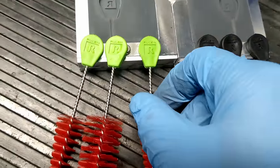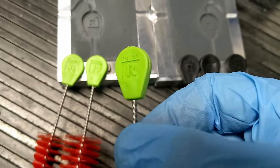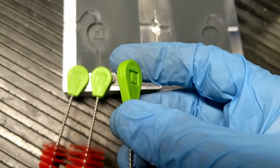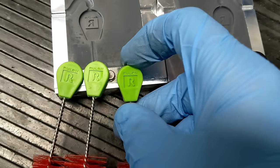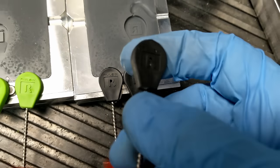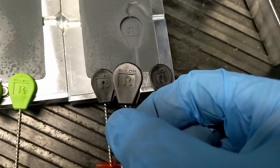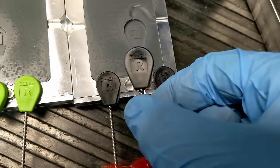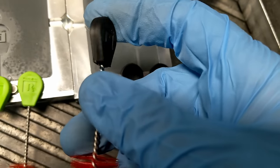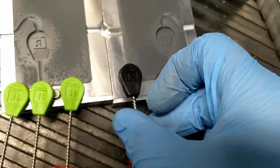Using a low-temperature TPE, it flows pretty great and has good detail — especially with shallow details. But with any high detail it really wants to grab. That's the soft squishy TPE that worked great as an overmold. With low-temp polypropylene, it really wants to sink and warp — you can see pronounced warpage on both sides. These were shot at 320°F. It's passable, but you can see how the mold degrading is starting to degrade the part. Different materials mean different flow rates and different temperatures.